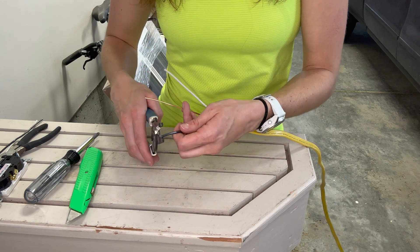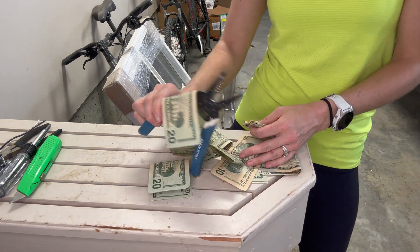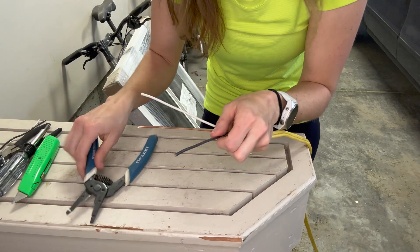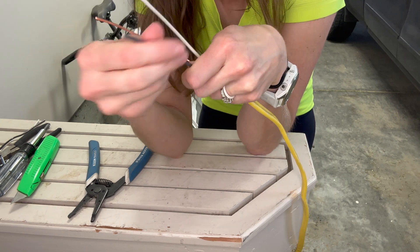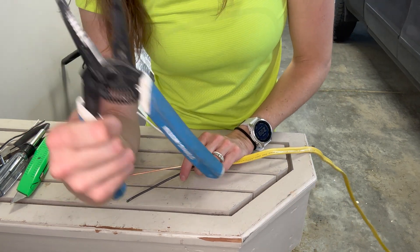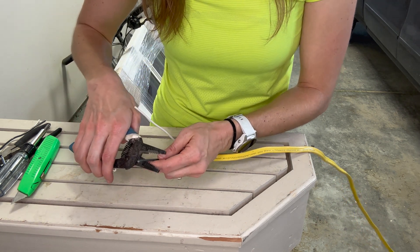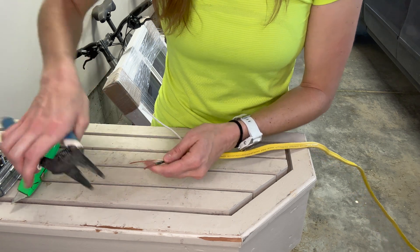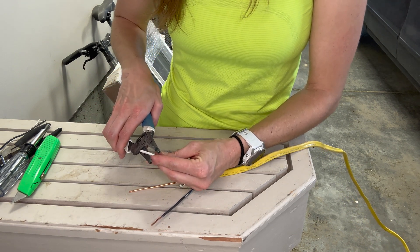So what I'm going to do is take a little bit off. Now this is a wire stripper. It has different sizes based on the gauge of the wire you're working with, and it's going to allow you to take the sheathing off the outside because there's wire in there. This is just the guide to show you which is which, so you have a kind of idea which wire is going where. Don't cut too small because you don't want to damage the wire beneath. It'd be better to start with a bigger cut and not get it all the way off, then realize you need to go a little bit smaller — just go one size up. Because if you damage and cut your wire, you're going to have to trim back so that you don't have a wire that's weak and could break off on you.